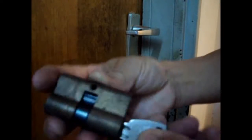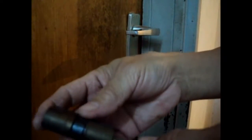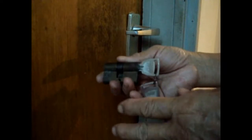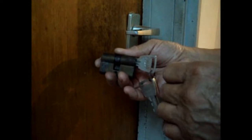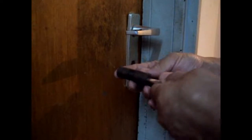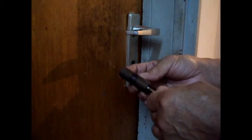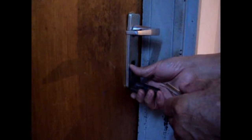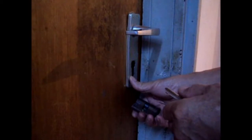So the appropriate length for this kind of door is not this kind of cylinder which has a long protrusion, but rather a shorter one which might be four pins. However, it protects the door — it protects the cylinder from being snapped. Because this kind of cylinder will be just protruding almost one eighth or nothing on the surface of the armor plate.